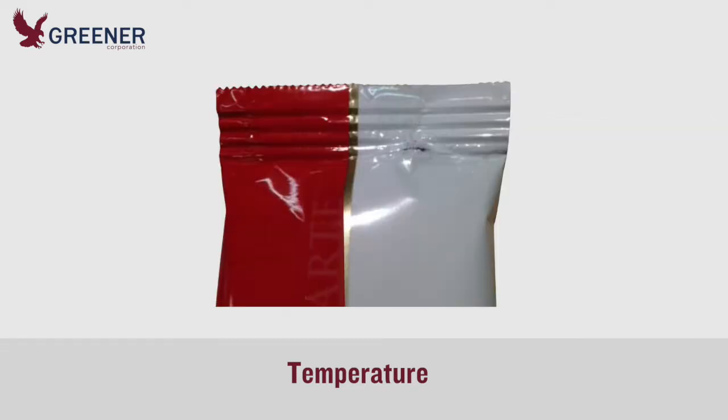If the knife fails again, even with the extra heat, the mechanic might decrease clearance until the knife cuts. They may not realize, however, that the intermittent crushed and split seals that develop soon after are caused by the incorrect heat and clearance adjustments. In this case, the fastest and least expensive strategy would have been to readjust or replace the knife and anvil when the problem first appeared.